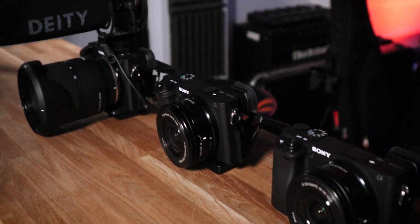With this new live streaming setup we're going to do something a little bit different — we're going to use a camera switcher. The camera switcher I've chosen is the Blackmagic ATEM Mini Pro ISO. There are loads of different versions depending on what features you require, but the important thing about the Blackmagic ATEM Mini camera switchers is that we can connect up to four HDMI signals, meaning you can connect four different cameras and seamlessly switch between them during your live streaming performance.